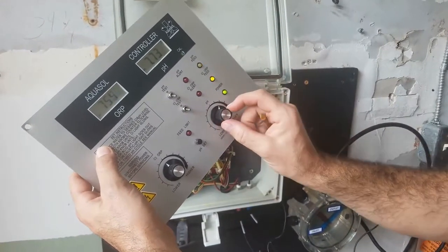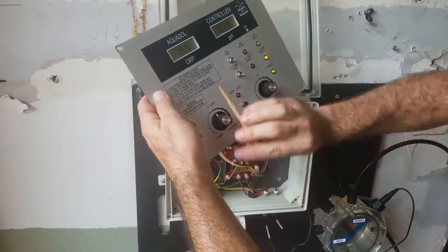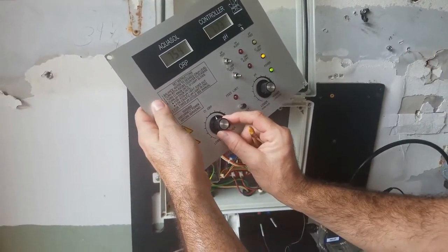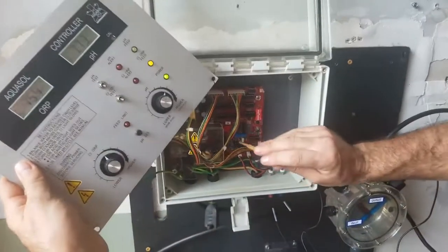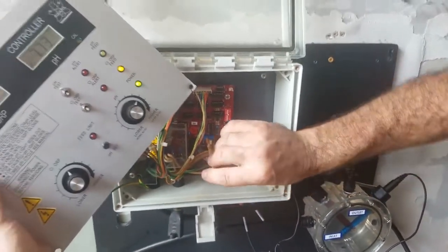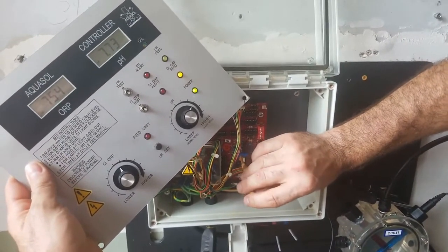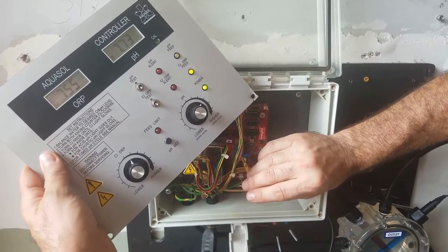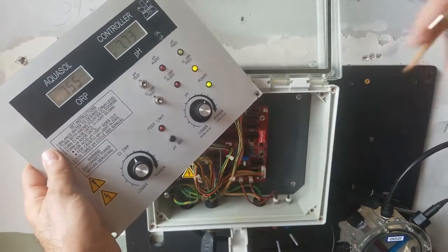To move on to the ORP side, we'll take the pH out of the equation. So if we want 3 parts per million to be straight up and down at 12 o'clock, then we're going to move this a little bit higher to reference our 4.0 parts per million that we tested. Then we'll go to the left potentiometer and we will slowly adjust it until our chlorine feed light comes off. Now, if the chlorine feed light was off, we would do it until it turned on. So that's basically our sweet spot — this matches where the pool is currently at.